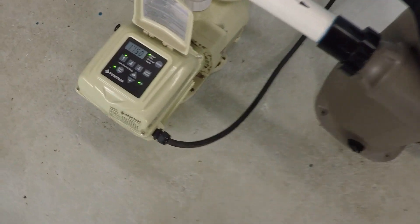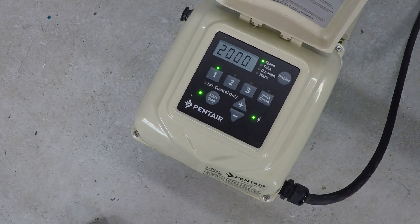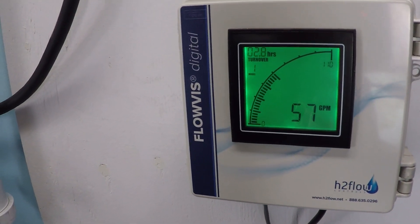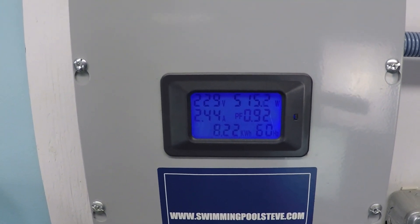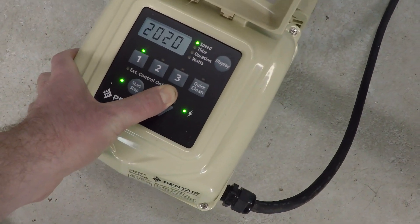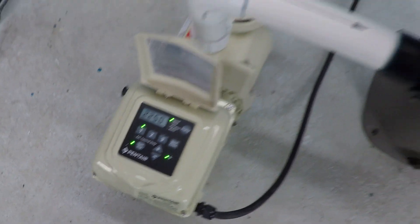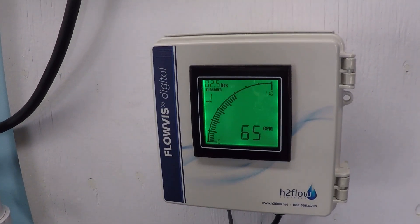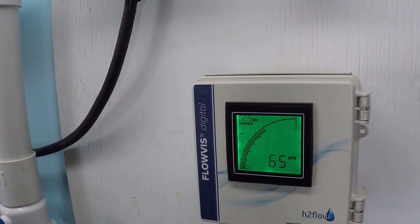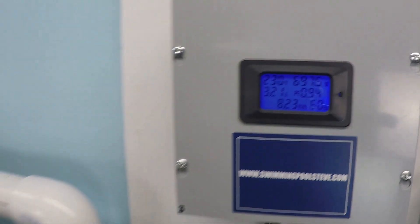And that's the significant thing. At the next step up we're seeing 56 to 57 gallons per minute, 515 watts, 2.43 amps. Then up further: 65 gallons per minute — and this is just going through a single 2-inch discharge pipe. We're barely even getting the motor cranked up yet, and we're at just under 700 watts, 3.2 amps.